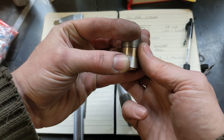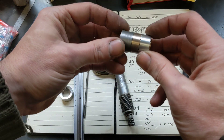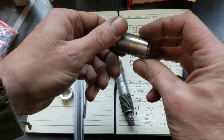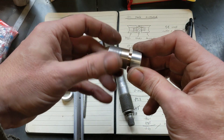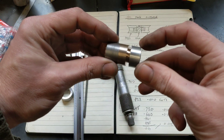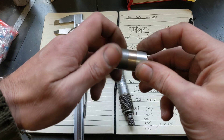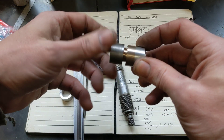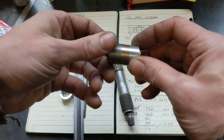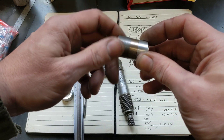I hope that's clear. I'm quite pleased with that — it's quite a lot of work and quite a lot of fiddling around. Yes, I know somebody's going to ask: how are you going to make sure you tighten it so it doesn't come loose? I noticed that if I keep turning to tighten this piece, when I get to the end and it's snug, it loosens off the other piece. And if I tighten that piece to the end, when it gets snug it loosens off this piece, because it's a left-handed and right-handed thread.